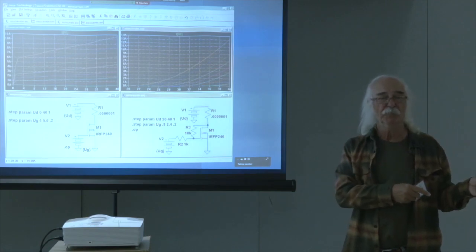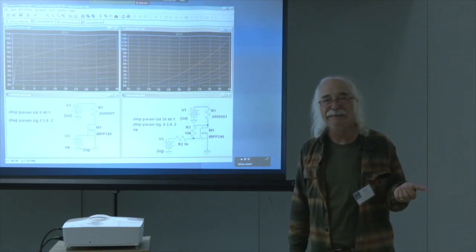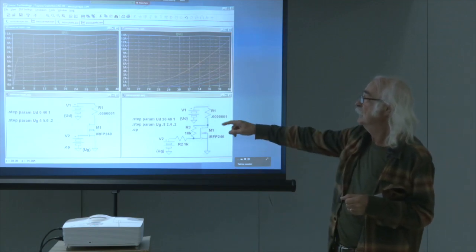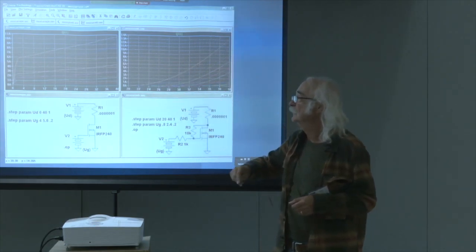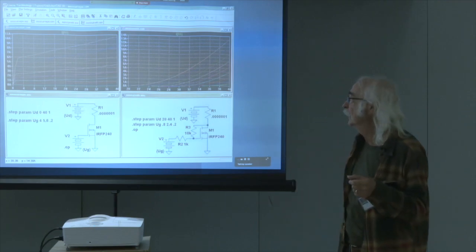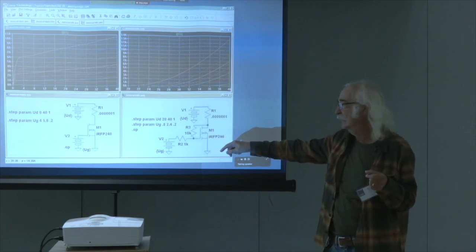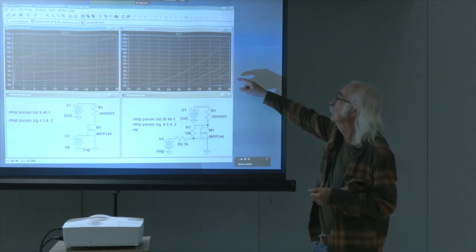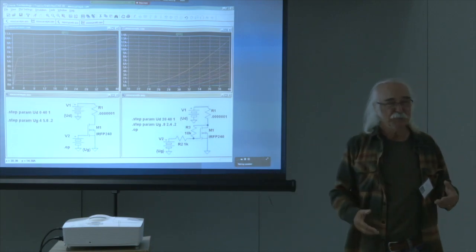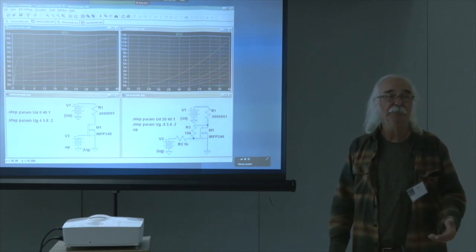Now, kind of off the subject of Hiraga, but going back even further, we have a guy whose last name was Schade, S-C-H-A-D-E. I forgot his first initials, O-E, and I forgot what his name was. He was the guy who said, you take a MOSFET, here are the characteristic curves of a MOSFET, and they've got this straight line thing going for them. And it's a classic FET scenario. However, if you give it a little bit of feedback like this, where you take a resistor off the drain back to the gate and drive it, you get a different set of curves. And those curves look like triode tubes. It's the dumbest, cheapest trick you can perform on a gain stage to give you that kind of tube characteristic, negative phase, second harmonic.